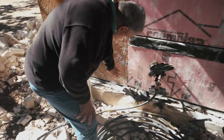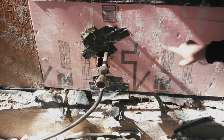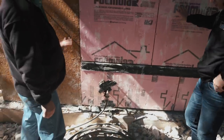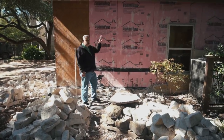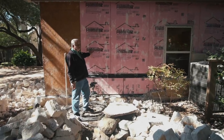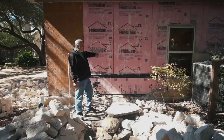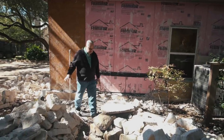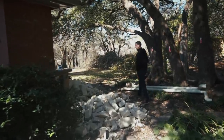Down here there's evidence where this section got wetter than the rest of the wall, again down by that brick lug. Not a lot of care for flashing details - you can see some melted XPS, some duct tape put on by somebody at some point. Not doing a whole lot of good, and yet the crazy part is there's not a lot of rot and damage. This is a great example where it's a really expensive house, but the bones of this house, conceptually, are like a lean-to. There's no insulation, a little bit of sheathing, and any water that gets behind the system just simply dries out.